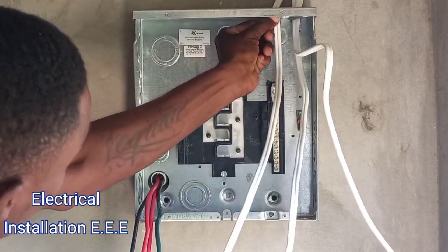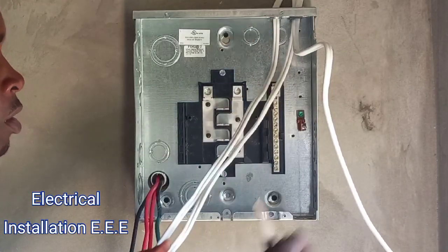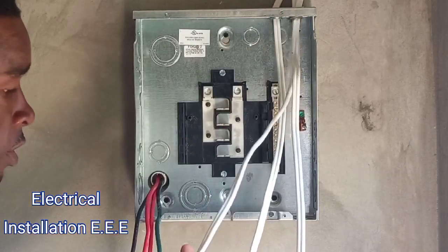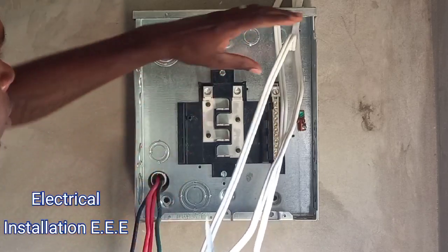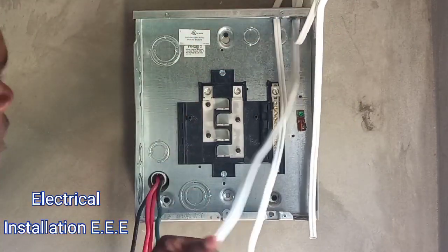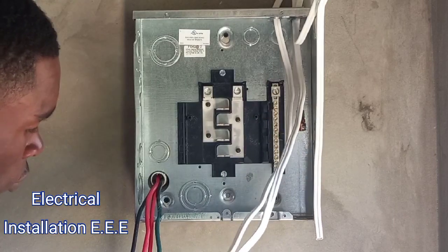Alright, these wires — you notice we carry them down in conduit. I've got one light circuit and this is my light circuit. But it's the same — three wires, actually the same size, 2.5mm — they use that right through. But I have to identify the light circuit, which is this one, and these are two plug circuits. So I'm gonna strip them.